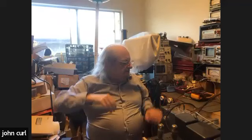What we really worry about and what really is important is open loop bandwidth. That's the bandwidth you can't measure easily. You have to predict it or do special test conditions because it's without negative feedback. Without negative feedback, it'll have a really, really high gain, like this amplifier here, until about a couple of thousand cycles, and then it'll start to roll off at 6 dB per octave. It invariably has to roll off because it will oscillate if it doesn't. And it has to roll off a lot before a certain critical zone where there's too much phase shift, or the darn thing will turn into an oscillator. And so we're stuck with that.